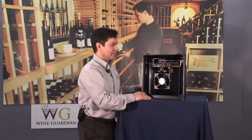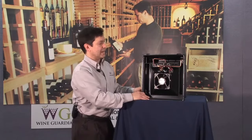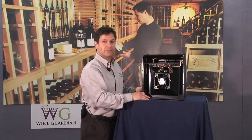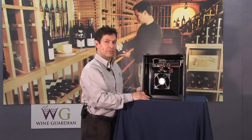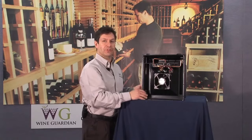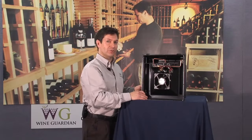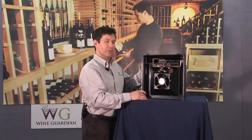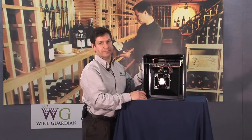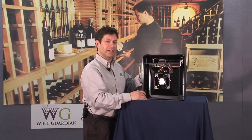The humidifier is really designed to be used with cold water or warm water, probably to a maximum of 100 degrees Fahrenheit. As you increase the temperature of the water, you also increase the capacity of the humidifier, its ability to add moisture into the airstream. Like I said, 100 degrees Fahrenheit is max.